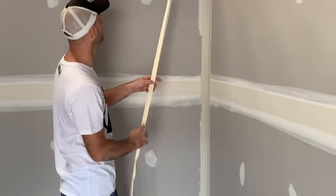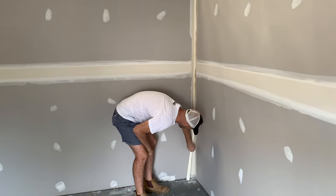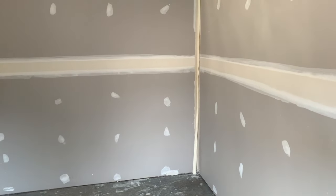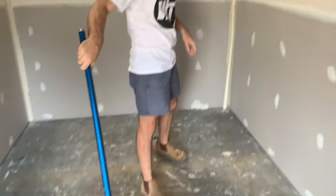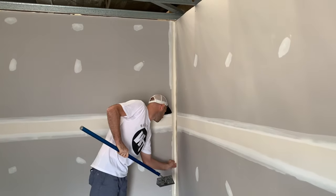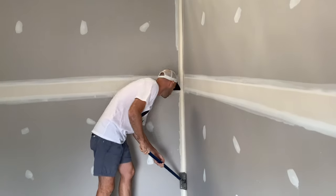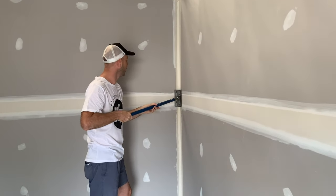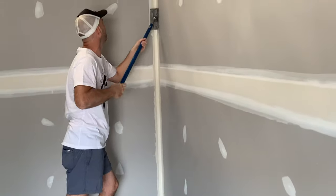What we're doing now is just placing the paper tape into the internal corner — just push that in very lightly with your fingers. Let me just grab the corner roller. Some guys like to just dip it in a little bit of a bucket of water. The best way to locate it in the corner is just to start in the middle and apply some light pressure down and up — nice and easy at this point, not much pressure. Once it's located, then we start to put some firmer pressure on the rollers and find the centre of the internal.